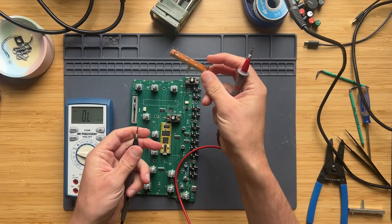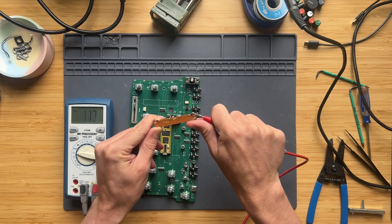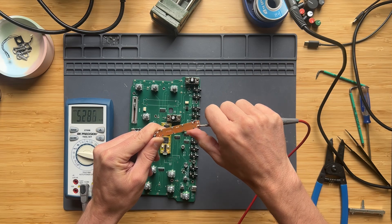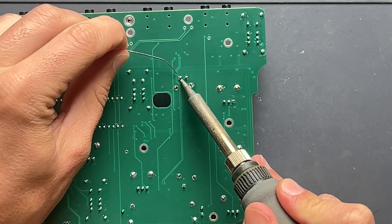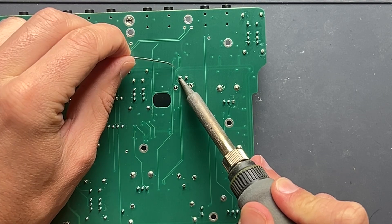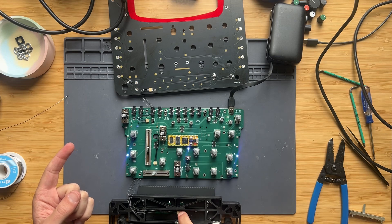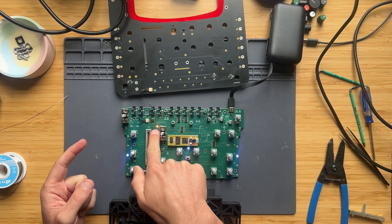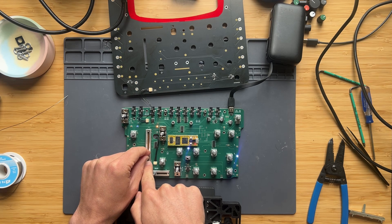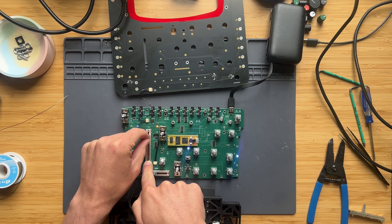Here's a fresh slider. I've used my multimeter in resistance mode to confirm that the resistances are working as expected. I'm just going to solder the new slider in. The envelope is looping — and hey, it's fixed! It's all behaving as expected.